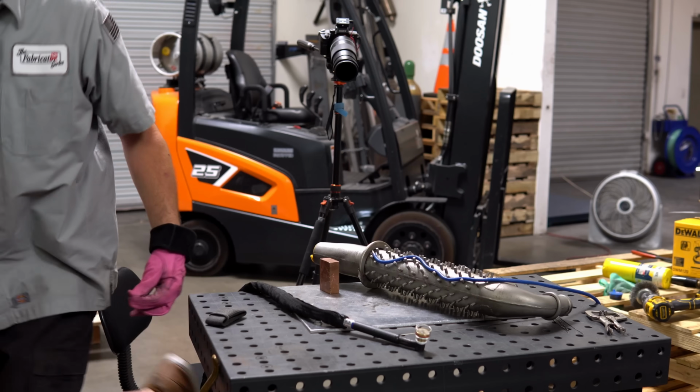I'm not even going to edit that out. Okay. Well, I must have done a crappy job on sharpening this. Arc start was all over the place. Okay. Concentrate, Justin. Don't get distracted. Blend. Okay, I'm just going to run off into a tangent here and get this bead tied in real quick. That way it doesn't become a runaway later.